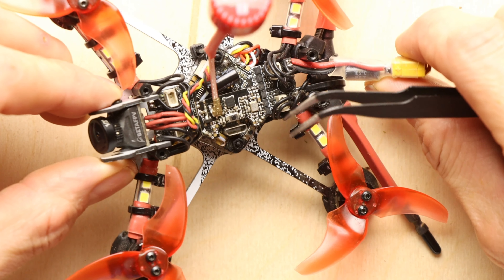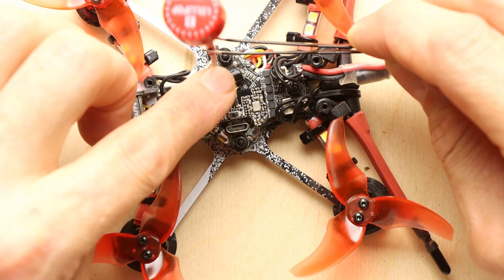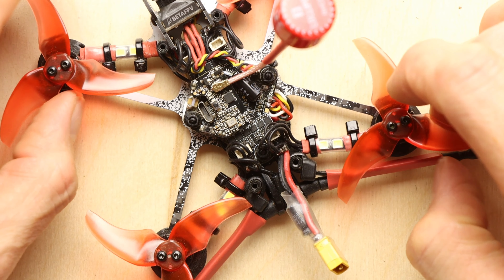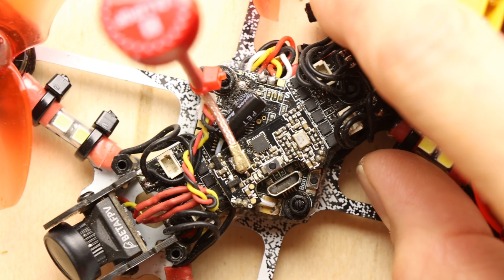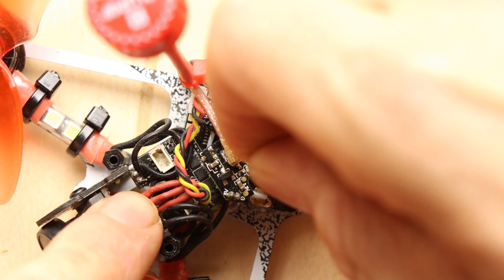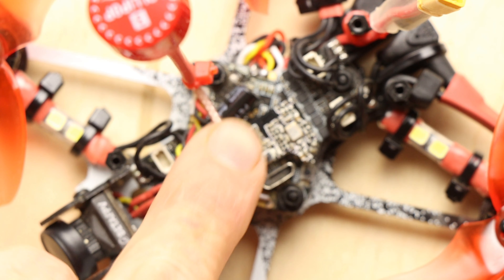Just a touch of solder on the tip and on each side we just made it stick there. If you watch my other antenna mod where I did the crossfire, you'll see another way to do this where you sheath it, expose the active element, and the outer core is the ground. You'd put the earth joined to those two outer pads and the active element coming through to the front one. I've got these plugs from Drone Authority and from HobbyRC — I'll put the links. I've got two of them and I'll probably do this to the standard Tiny Hawk as well.